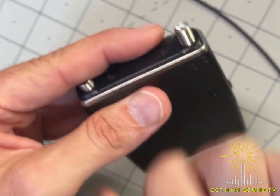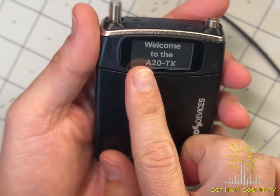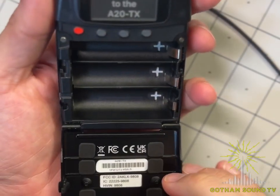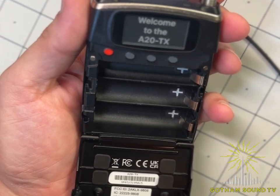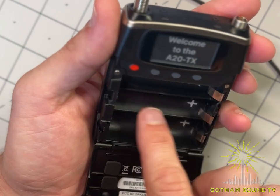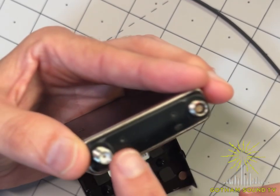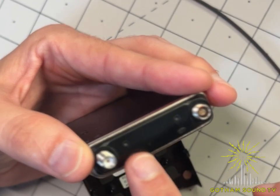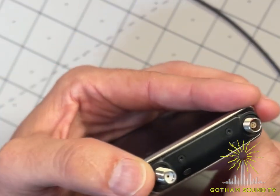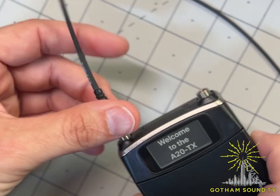The construction feels good — feels like metal. The e-ink screen is on even with no batteries installed, which is cool: the screen just stays on displaying whatever was last shown. You've got a bunch of different buttons, three double-A battery slots, a three-pin Lemo input, and an SMA antenna connector on top, plus two screws for future accessories including the switch.